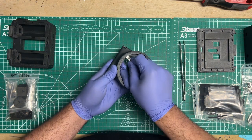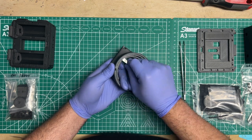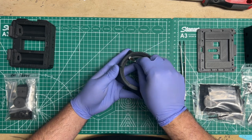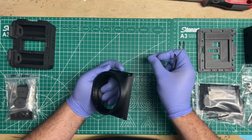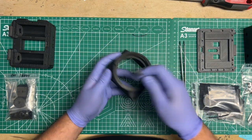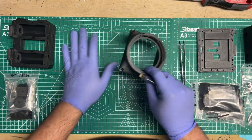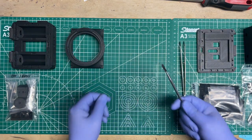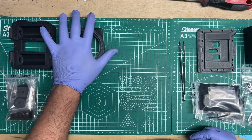But then I just try to do it on the underside and then on the top side of the support. And if you did everything right, then the support should just fall out just like that, and then you just got to do a little bit of cleaning. All right, so that's basically how you'd handle the supports if you're following my print settings. It should be as easy as that. And once again, love this tool. It's the MVP of my shop. So that's what you'll do first.